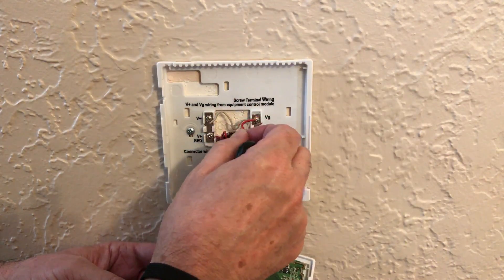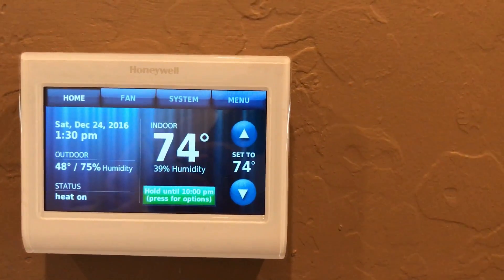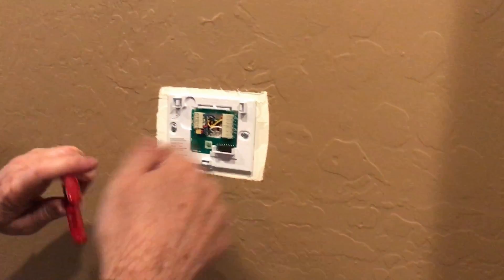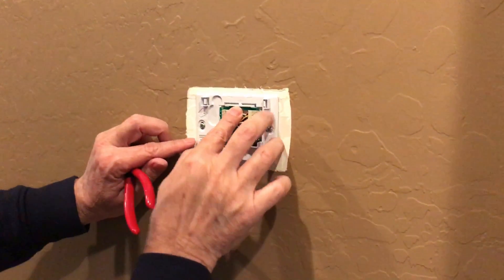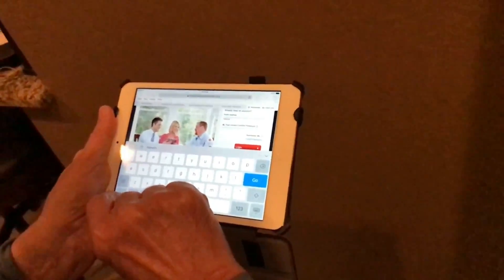The problem is that I only have four control wires between my existing thermostat and my HVAC unit. My original plan was to install the Honeywell smart WiFi thermostat because a few months ago I helped my dad install the Honeywell unit into his home and I was pretty impressed. The installation was very straightforward and we had it installed in under 30 minutes. The app was very intuitive and the setup was a breeze. The only drawback my parents experienced was with the anticipation or recovery feature — basically it pre-warms or pre-cools the house before the scheduled start time. Since they have a multi-zone system, it was creating problems with the schedules on the not-so-smart thermostats in the other zones. They turned the recovery feature off and everything worked fine. We did connect it to their Amazon Echo Dot and from what I hear, the Echo is the star of pretty much every party they have.